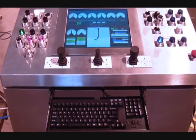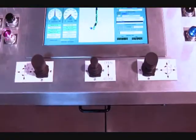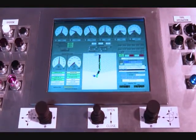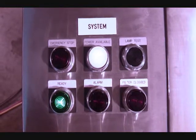Artisan can be operated in different modes. Joint mode is the basic mode where joysticks control the position of the individual joints of the Artisan manipulator arm. To enter joint mode, check the system: the computer is on and does not display warnings, the pump is running, and the Ready green light on the console is on.